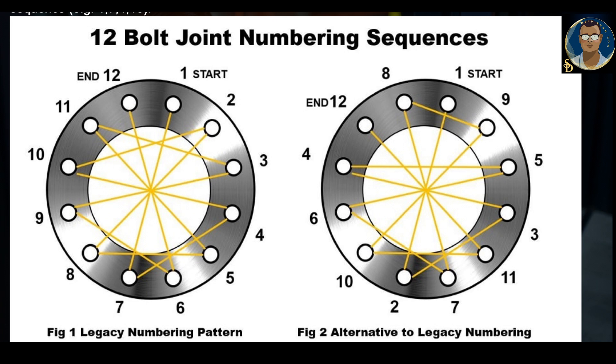In the first option, numbering is one, two, three, four, five, six — simply in the clockwise direction. In the second system, numbering is done in the order of tightening. So in the second option, one and two should be in opposite quadrants — one at the top, two at the bottom. If three is on the right, four will be on the left. This is easily understandable if you follow the picture.